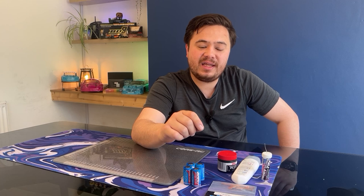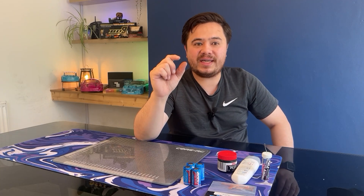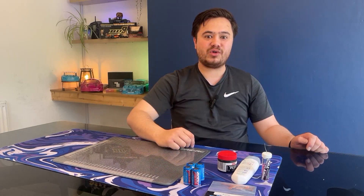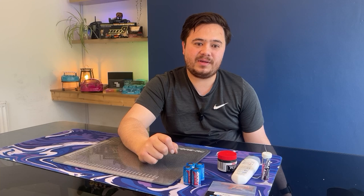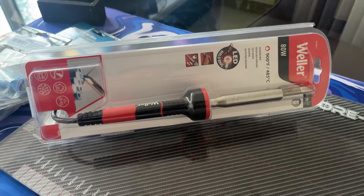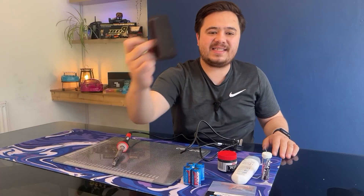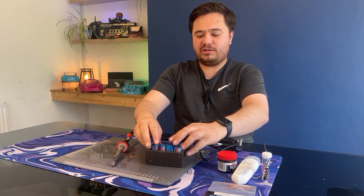What we're going to use instead: we need a soldering iron that is above 60 watts, and it also needs a wide tip — a big tip — so we can get some thermal mass without heating them up too much and damaging the cells. After listening to everyone's advice, this is what we have: a Weller soldering iron bought on Amazon with a 10mm wide tip. Additionally, to help the process, I made a little jig so our cells can sit in there while we do any soldering, keeping them together. We've got all our bits — let's plug the soldering iron in.